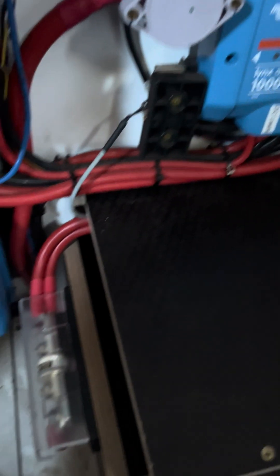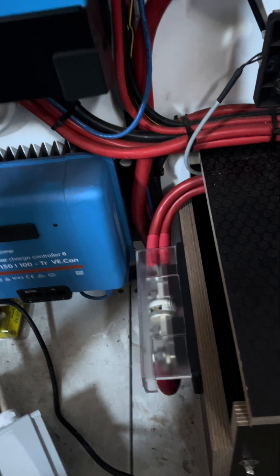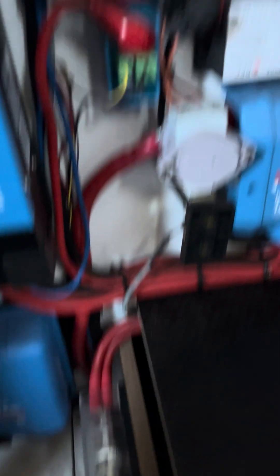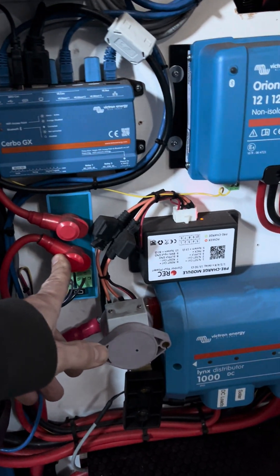But it's not quite as expensive. This is actually 560 amp hours — eight cells gives you 560 amp hours at 12 volts. It has all the cabling; I always use tinned cable. It's got a Class T fuse fitted and a Victron Battery Protect for the DC loads.